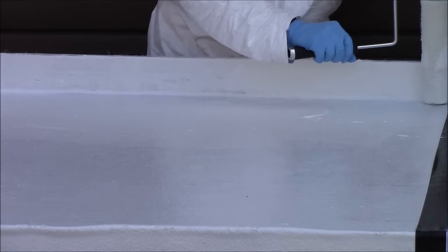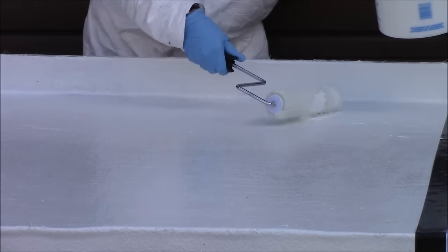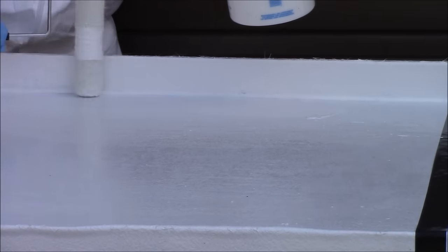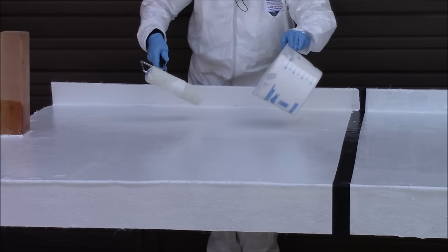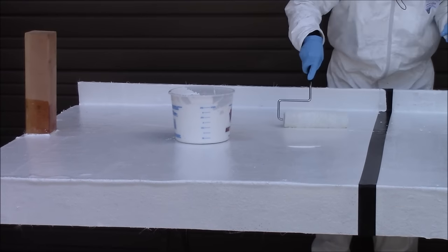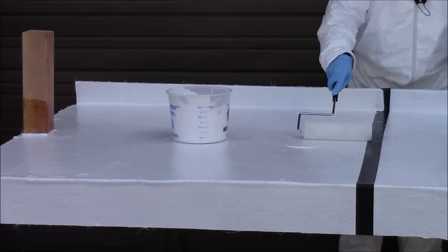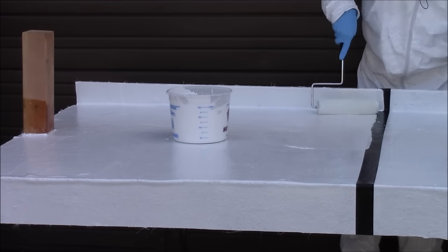Recall that in the beginning we did a caulk line around the post and up against the house before we did the primer coat. Then we did the primer coat over top of the caulk, and we brought the two-ounce chop strand mat over top the caulk. You might not be able to see it, but it is watertight now. You could hit this with a fire hose and water would not get in between that caulk. I believe that's the best way to go.